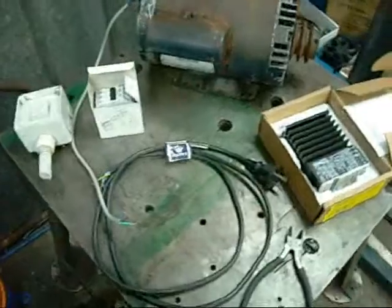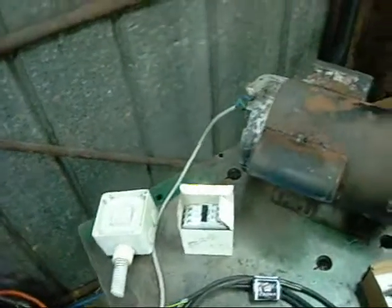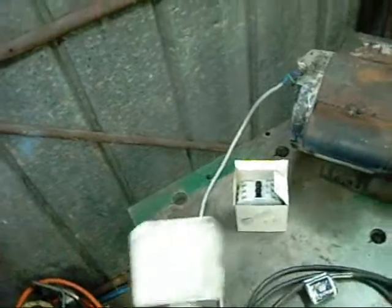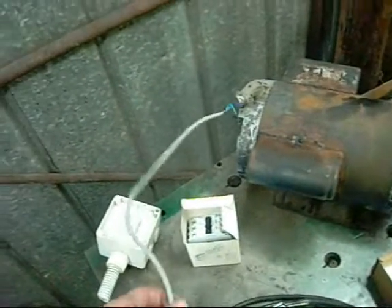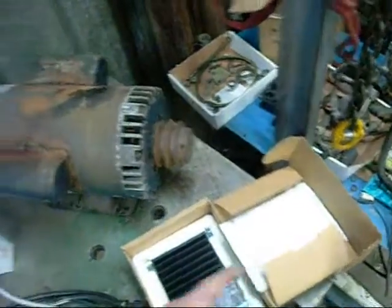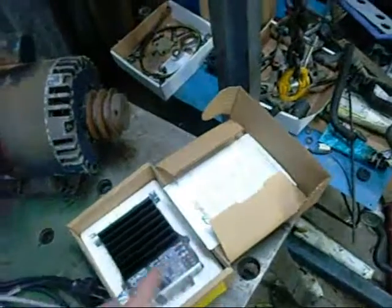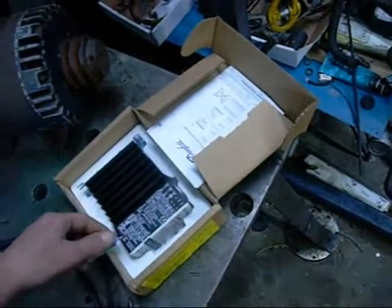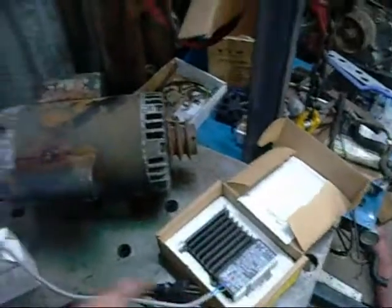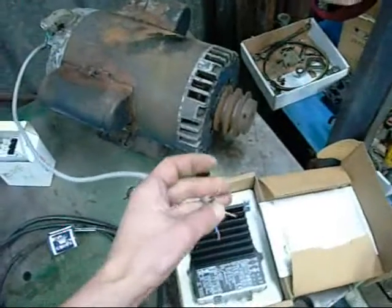Your application will dictate what wiring you need. You'll have wiring going from the starting torque limiter to the motor, and your mains cable going to your contactor or isolating switch — you can use either. Just depending on how your machinery cabinet is set up, as long as you have the starting torque limiter before the motor. You don't need to worry about the caps, and you don't need to worry about switching across. Although you can switch the live phase L1, I don't recommend it — it leaves things open to electrocution if you think it's isolated but have only isolated one of the two active wires.